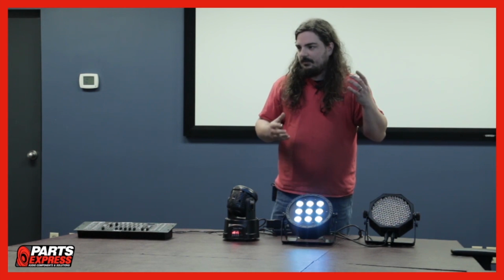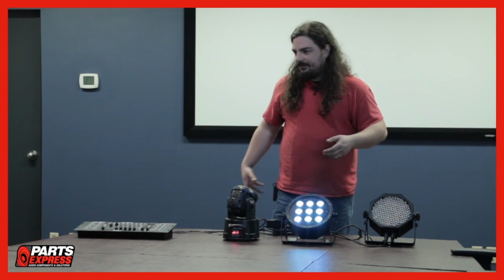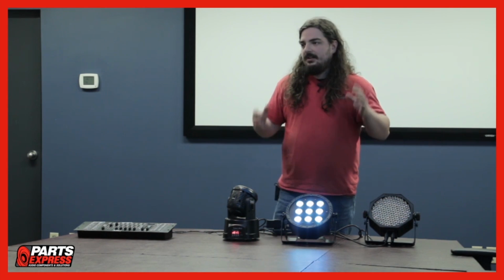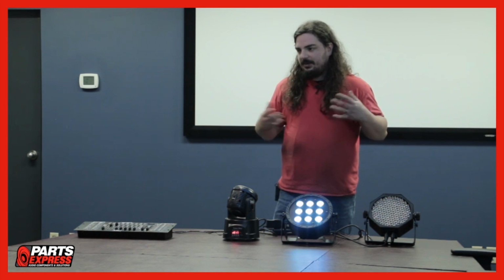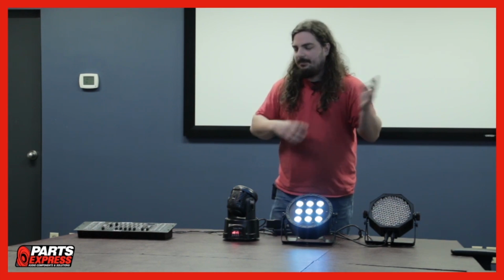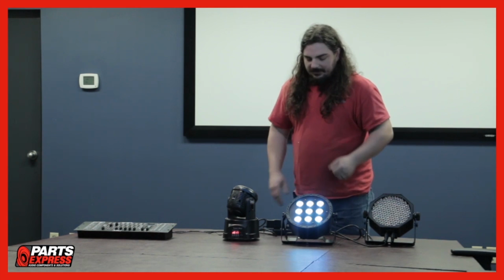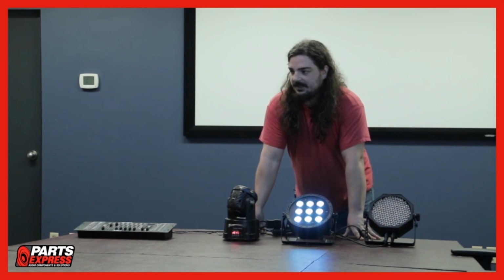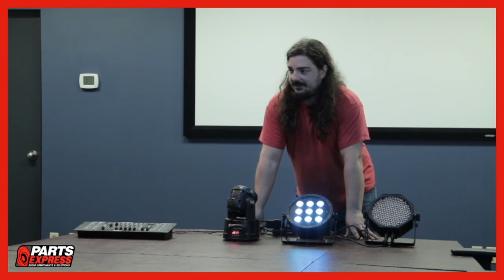Same with some of the less expensive wireless microphones, wireless guitar packs and all that kind of stuff. Any of those that run at 2.4 gig can start to have issues if you go into a place with a bunch of Wi-Fi and a bunch of Bluetooth and all kinds of stuff messing with it. They work great when they work, but as soon as you start running into interference, it gets a little tricky, and it's very hard to get rid of that interference because there's so much stuff that uses that.